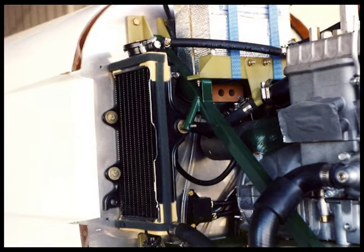Bruce? Tell them about your unique cooling system. The cooling system on the airplane uses two radiators that I got off a 250 Honda motorcycle about 6 months before Rotax came out with the same radiators. They're Japanese Toyo radiators. The great big hole in the front is a plenum, or at least provides air to the plenum, which is the entire cowl. At the very aft side of the cowl, there are these two radiators, and they are ducted out through vents at the side of the fuselage.